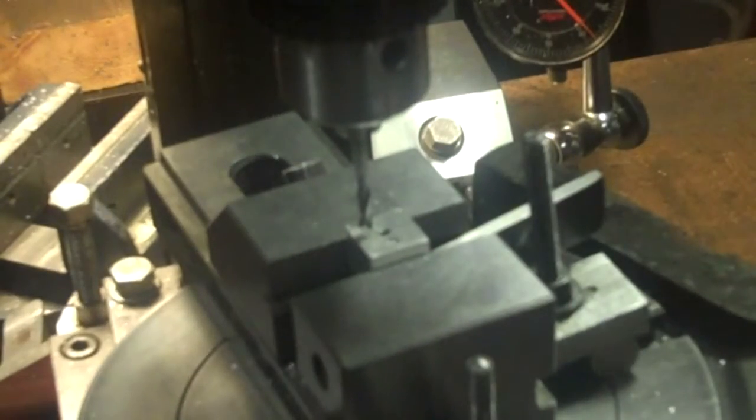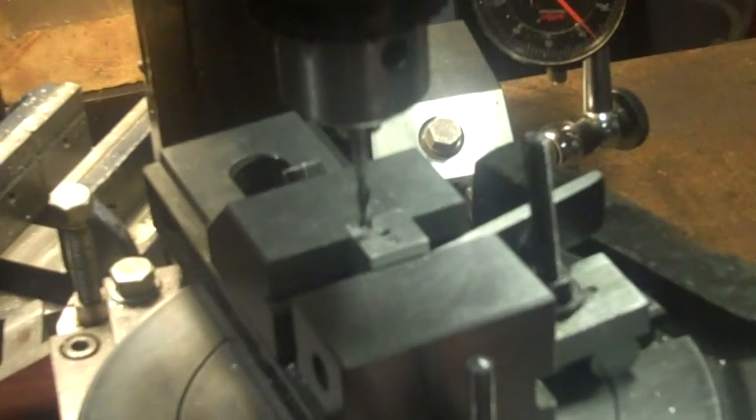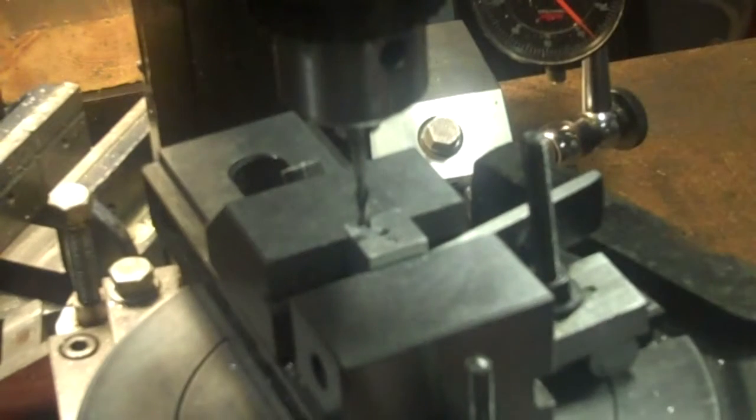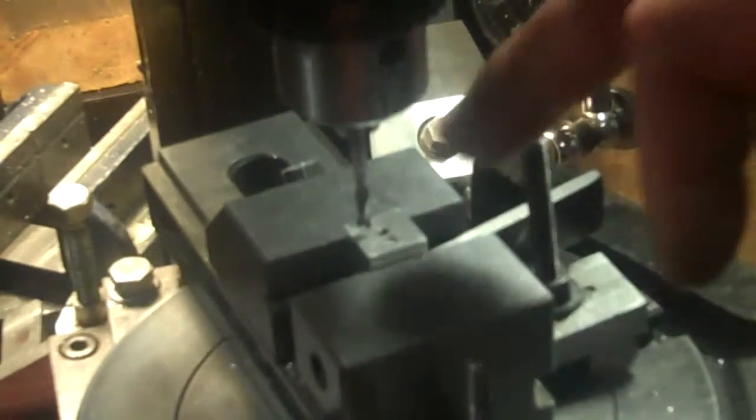Now, since I'm turning my rotary table backwards in the number of degrees, I'm actually at 255, coming down to 240. I'm actually going 240, then 120, because I'm going in a counterclockwise direction, so that my bit is turning this way against the outside, climb milling on the inside here. But anyway, I'm at 255, then I'll mill around here to 240, then back down to 235, and that would give me my 10 degrees on the 240, or 120 degrees off of this one here.